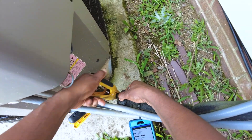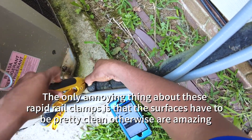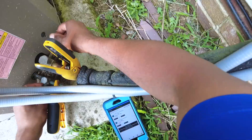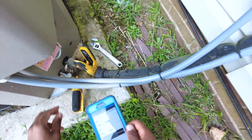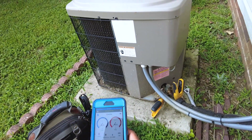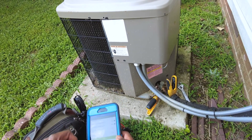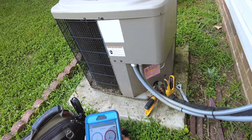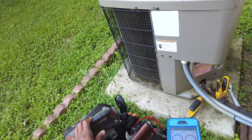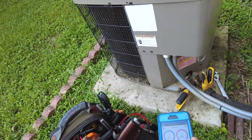Temperature just all over the place, and he has 73 — it's not really good at all. But with an outdoor temperature of 92 and 75-degree incoming air, that means your coil would be about 40 degrees.